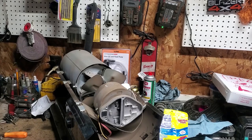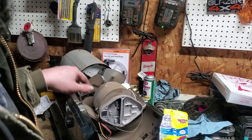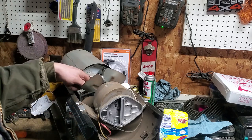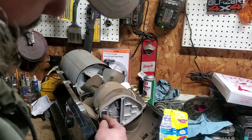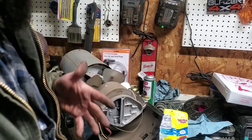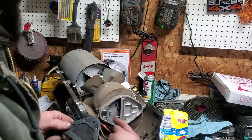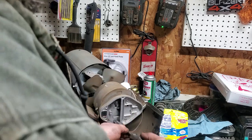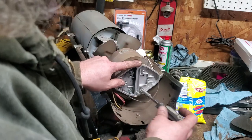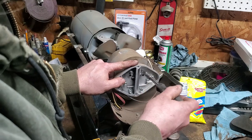There it goes. What you've got here is another filter, and as you can see it's nicely plugged. This is a cam-driven pump here that pumps diesel — or your fuel of choice — out of the tank and puts it through the injector nozzle. The whole reason it keeps shutting off is because this filter is plugged right to hell, solid. And it's plugged solid because of these little black chunks — the actual pump inside has some kind of different coating on it that's wearing off.